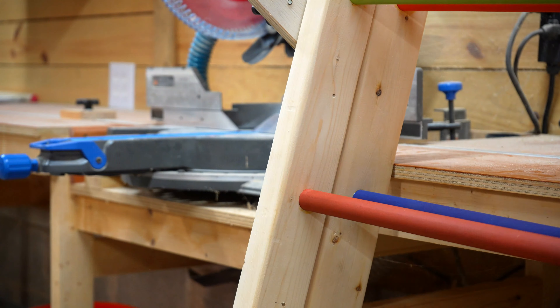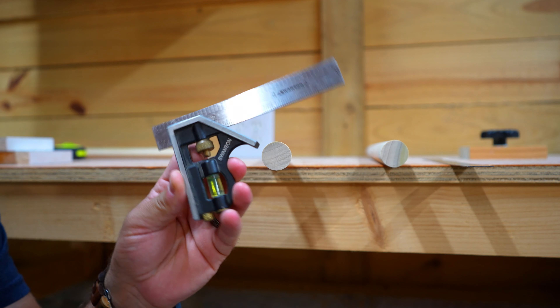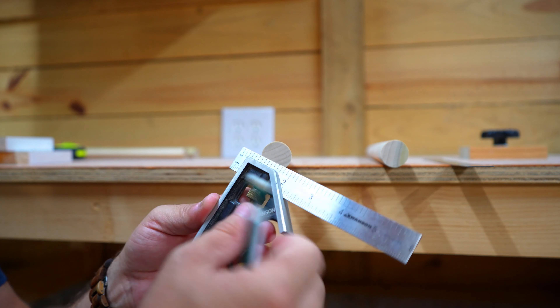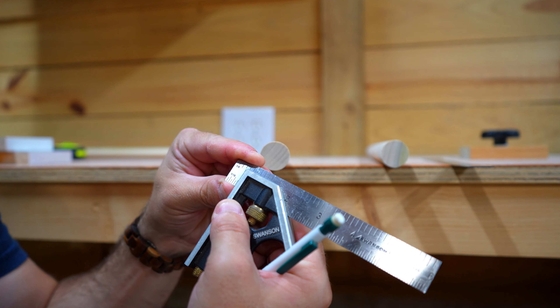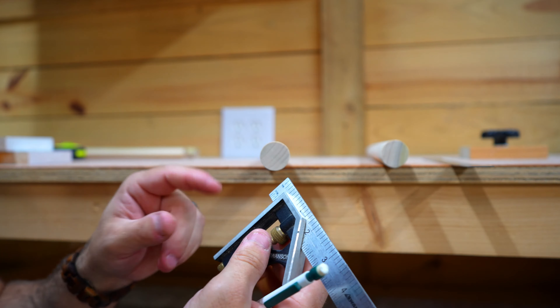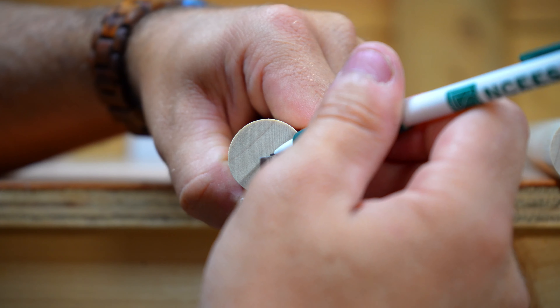I brought the triangle back to the shop for a modification. After a few days of him trying to climb on it, the 9-inch rung spacing turned out to be too wide. So on just one side, I'm going to add a rung between each of the existing rungs. Rather than gluing them in like the originals, I'll anchor these with screws from the outside so I can remove them later and return to the 9-inch spacing.